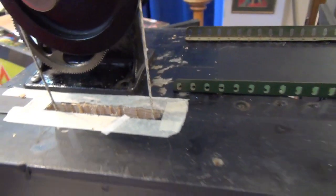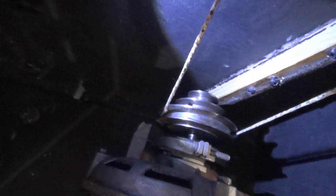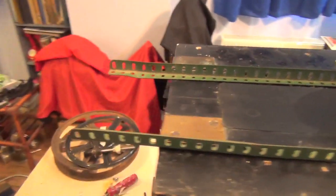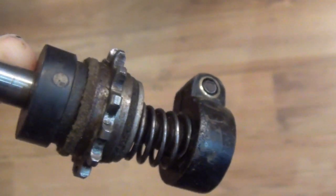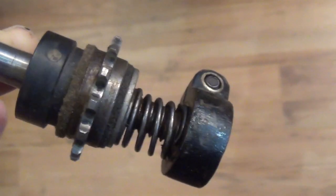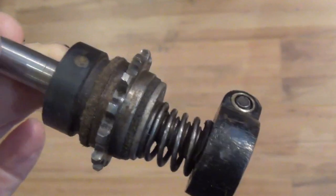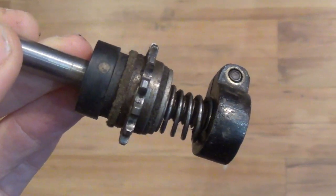There are some alternatives. On this big motor there were three pulleys, only one of which will be used in the drive — probably the big one — which means I could take a belt off one of the other pulley wheels to work the take-up. A couple of holes in the old box, and providing the clutch in this take-up system can be made to operate smoothly, that would probably do the job instead of the chain — just connect it with an extra pulley wheel added instead of that sprocket.